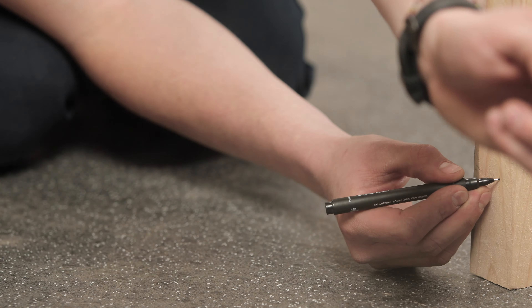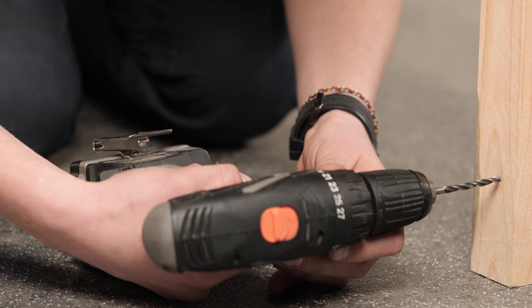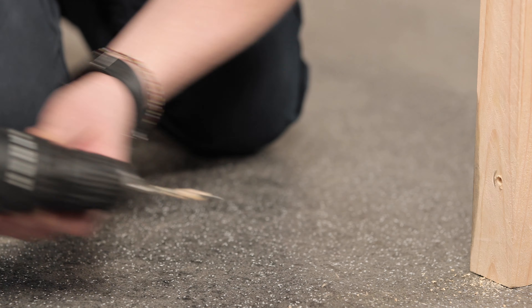You need to put the sensor on the side of the door where it opens and also low down, so it's not noticeable and the heat doesn't loosen the attachment. First, drill a hole into the door frame where the sensor will go. It must be just deep enough to allow the door to fully close.